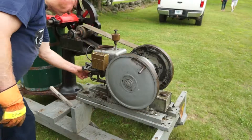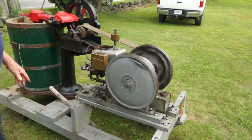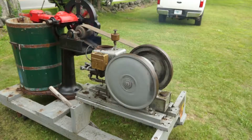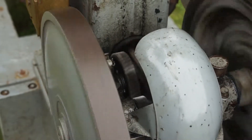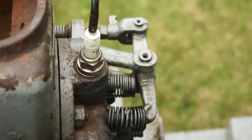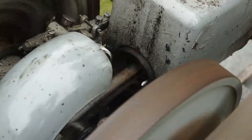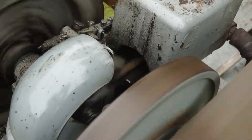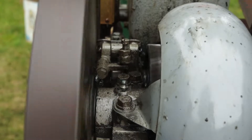So we just give it a little bit of choke. The intake valve draws in a charge of gas and it fires and it gets up to speed again, and then it coasts again — and that's where it gets its hit and miss. It hits for a minute and then it just freewheels until it needs power again and then it starts to cycle over again.